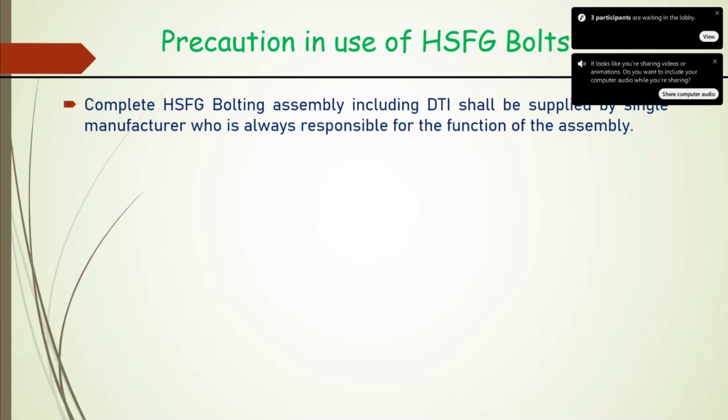So one manufacturer for one part may go to one side of the tolerance. If he sources the other component from another, he may go to the other extreme of the tolerance. That is not good, unless we tighten the tolerance many times higher than the minimum workable.